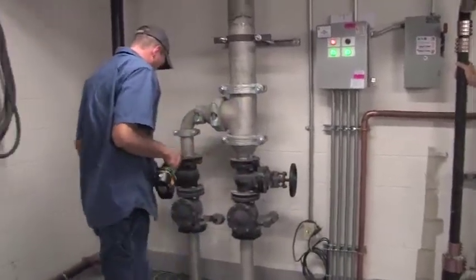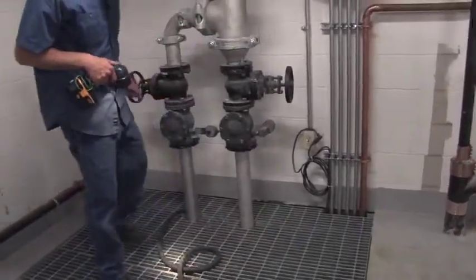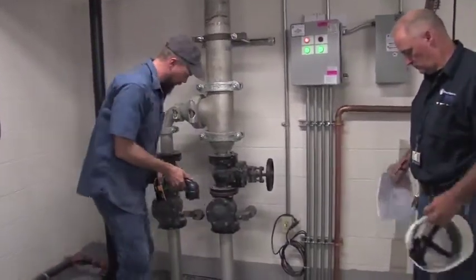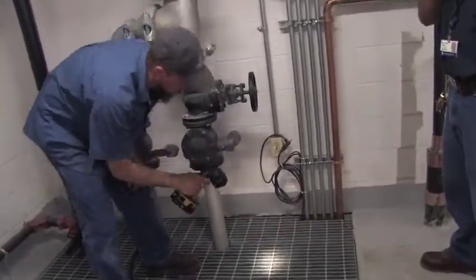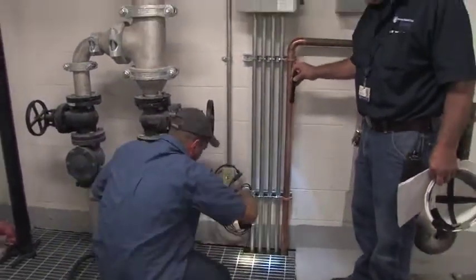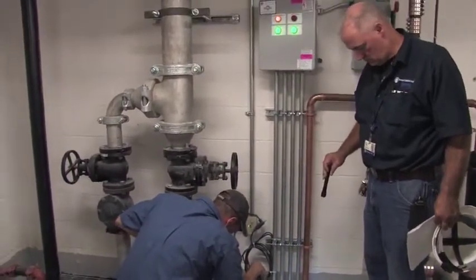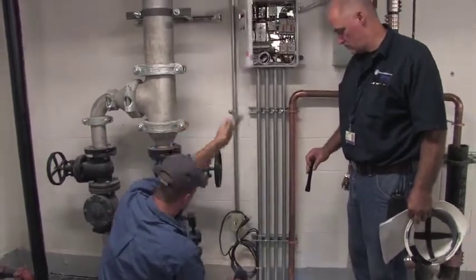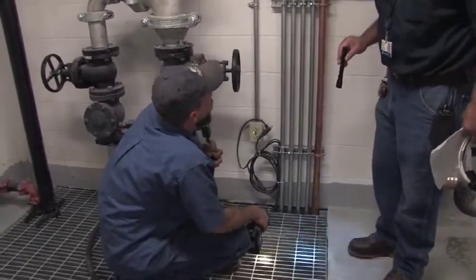I don't know how you're going to pull these ones — I don't see any float rails. Okay, so there's the top of the pumps — kind of hard to see with the grid. These are pretty good size. The float tree is coming right down the edge of the pit. Unless you really get on top of it, you've got one straight down. I'm just waiting for that last float to flip and you're good. You'll see the auto alternation swap to number two. Check valves are holding.